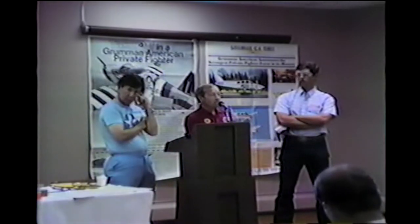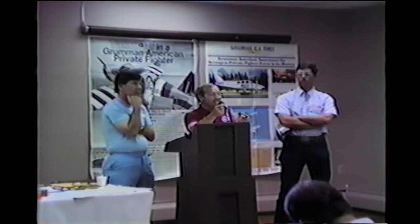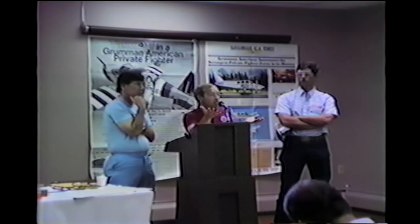And we have replaced so many of these things, it's a crime. I've been working with Lycoming, with Sensenich, with Gulfstream American, trying to get some kind of a service bulletin, an AD or something out on it, and I can't really get them excited because they say nobody's having any problem with it. Three-fourths of the airplanes that come into us are punched out. Now, I tried to come up with a longer drive bushing. There is one size longer made by Lycoming, but it's a 16th of an inch longer. Ain't worth changing. I was going to recommend they put out a service bulletin to replace the two short ones with the two longer ones, but that isn't enough to do you any good.